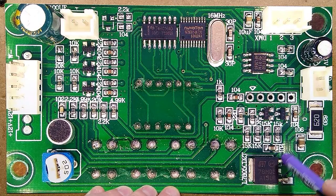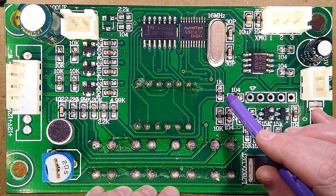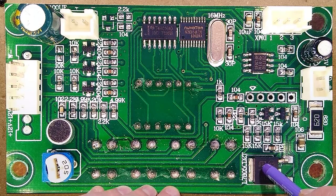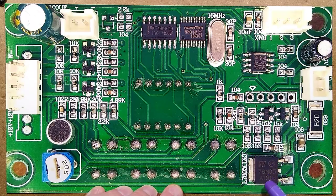The reason they've got a resistor in series with the regulator here is because this circuit board is actually powered at about 24 volts, and it just takes the edge, it takes the extra load, because the 7805 is a linear regulator. It dissipates the difference in voltage as heat. So that actually gets quite toasty. And this resistor here just shares some of that load. And as the current goes up, more voltage will be dropped across the resistor.